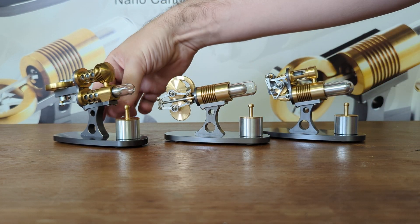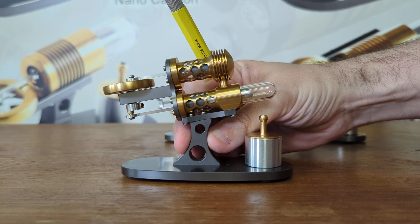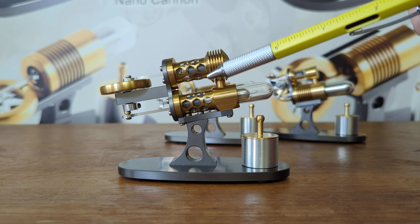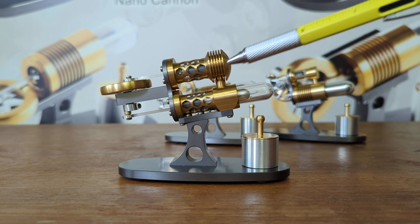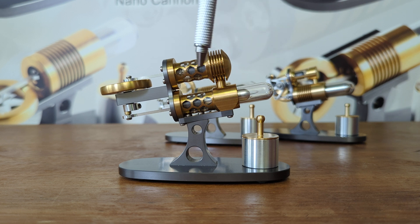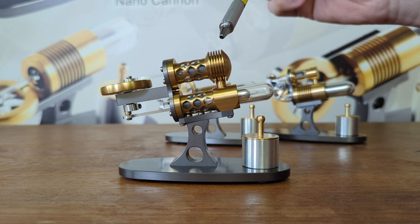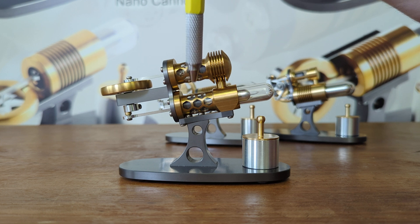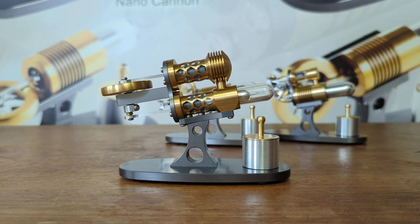With an alpha, just like the gamma, the pistons are parallel to one another. They're not on the same axis, but on this setup you'll see that both pistons are actually touching the outside of the cylinder wall. The displacer piston is still shuttling air between the hot and the cold side, but rather than being in one chamber, the hot side is here and the cold side is higher up on the actual power piston cylinder. The key thing is that both pistons are touching the cylinder walls, so it's just shuttling air between the hot and cold side.